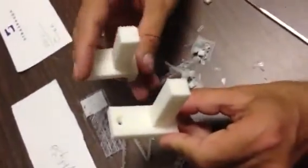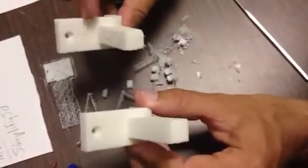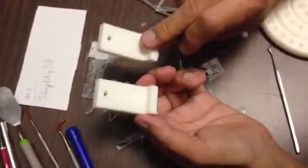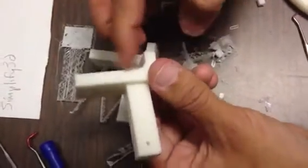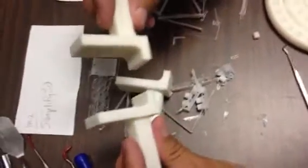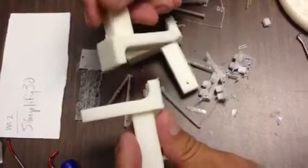The part is definitely better than the first one I did, where there were a lot more blobs. You can see there are a lot less on this one, and I'm assuming that's from going from three perimeters to two, and a couple other little changes — not major changes, but you can definitely see it's a lot better quality. But I still have blobs at the edges for some reason. I'm not quite sure why those are there. On the same printers, both M2, with Cura I didn't have any of those blobs, so it's some setting.